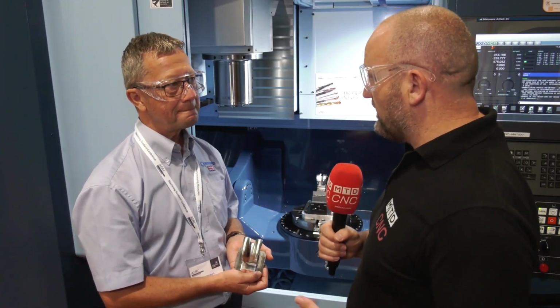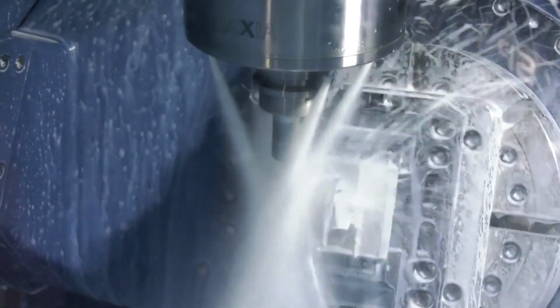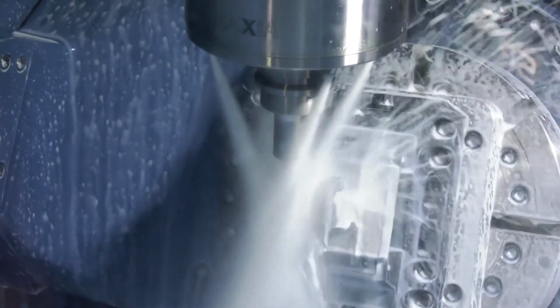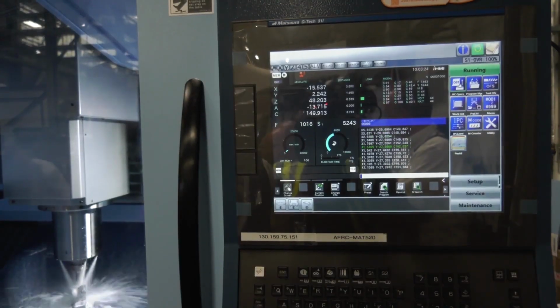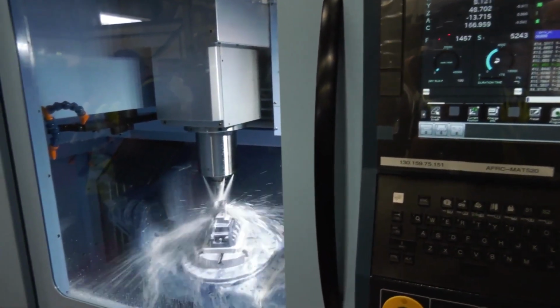Yeah, and barrel mills, lots of people are talking about them, but there are real life applications. You are selling barrel mills. Yes, we're selling them. We do a lot of export barrel tools as well at the moment. People sending them back for regrind, which is what we call remanufacture, of course. So we take the tool back to a new tool, send it back. So that's very good. It's an application-specific tool. People have got to start looking at it. You need decent software, so OpenMind is ideal for us.